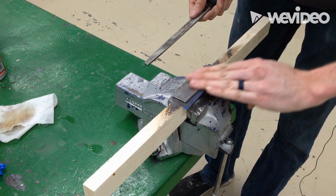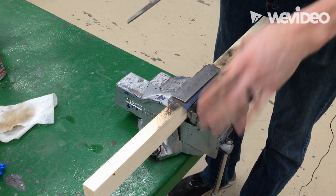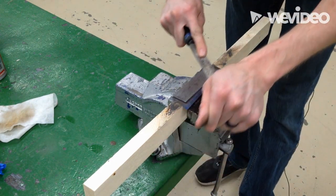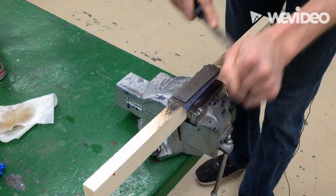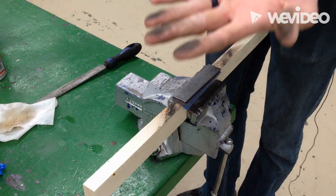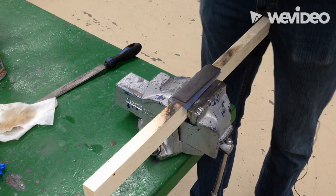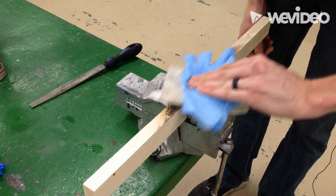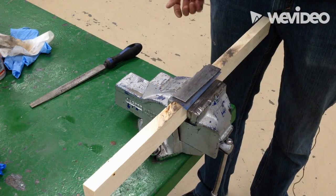So here I've got my surface pretty well flattened. Now what I'm going to do is a couple long, straight draws just to get rid of any of the cross hatch pattern that I'd made. So I just set it, drag, pull. You can see how I'm getting kind of metal dust everywhere. I'm going to hold on to my glove, put my rag in there and just give that a wipe. So now my piece of metal is cleaned on one side.